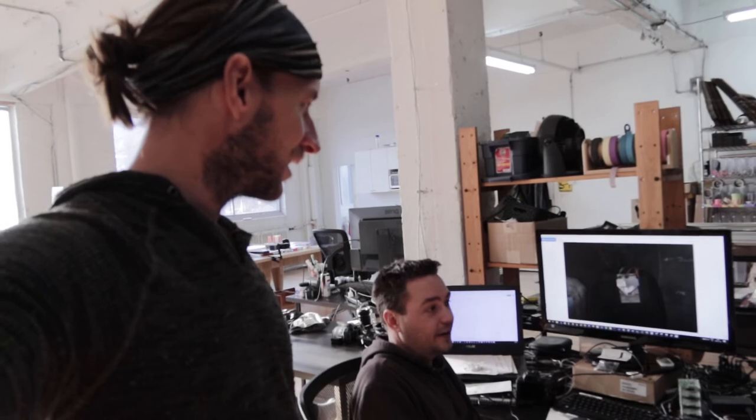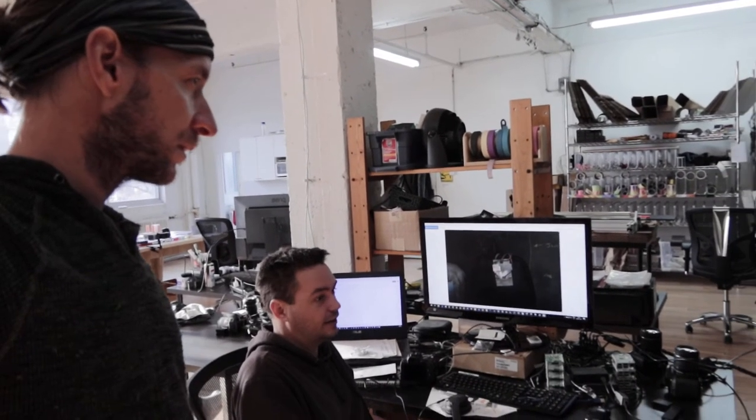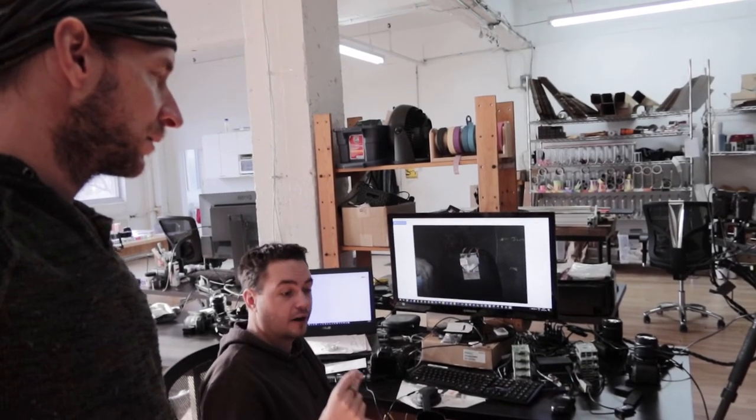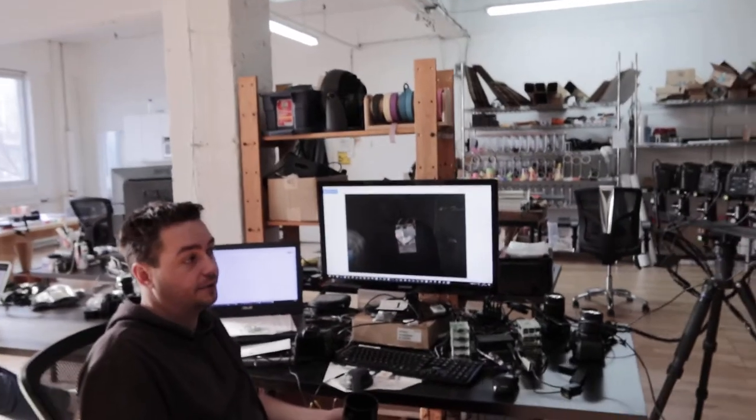It's crazy. Yeah, and it doesn't change the shutter lag, which is surprising because on the SL1 and SL2, if you put the mirror lockup, they are faster to trigger. But on the SL3, it's the exact same shutter delay. Whether or not you enable the mirror lockup, so that's a new thing.